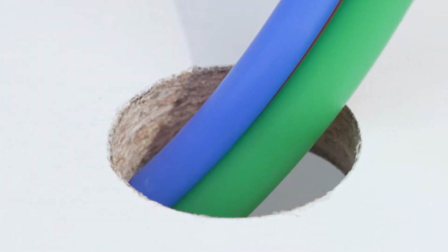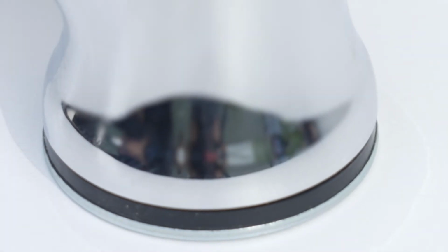Holding the foam gasket in one hand, lower the auxiliary tap stem and tubes through the hole in the sink ledge or counter. With an assistant holding the tap in place, reach up from below the counter and slide the wing nut onto the threaded tap. Position the tap in the direction we want and tighten the wing nut to lock the tap in place.